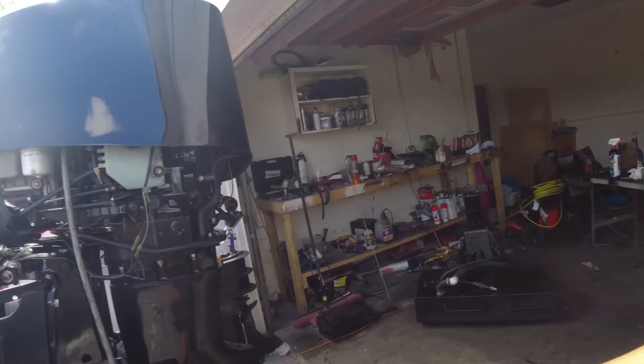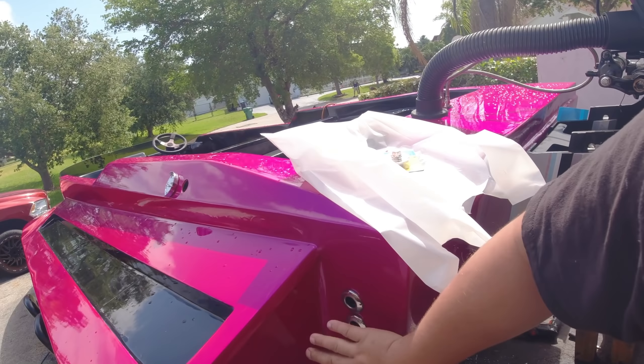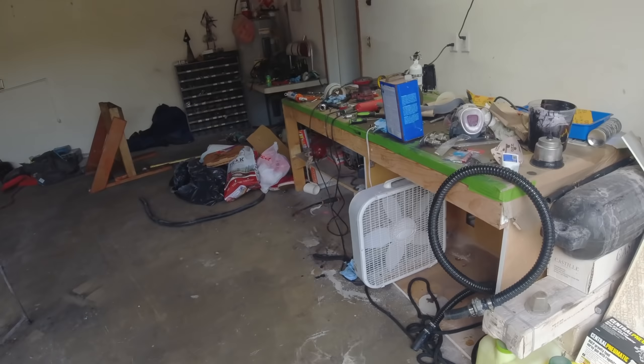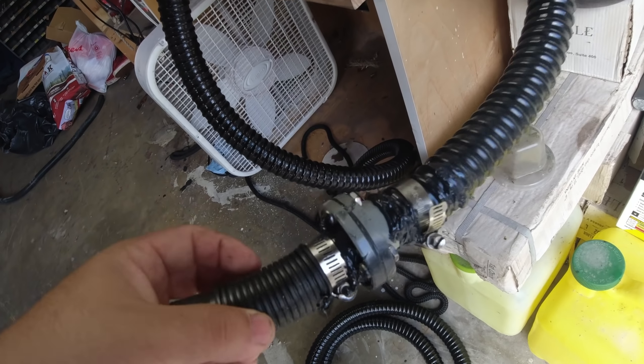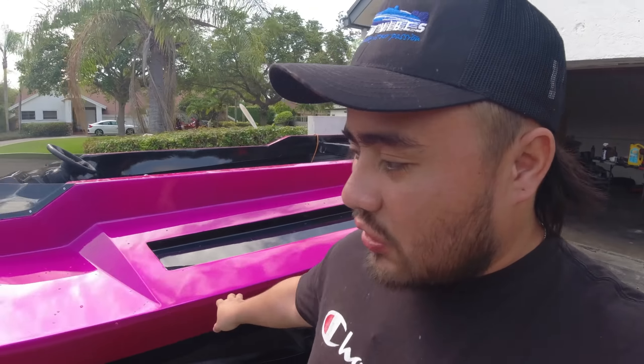We're close to going in the water. All we're missing is the fuel tank and I gotta put in the hoses for the bilge pumps. I've got some poppet valves — put some 5200 last night, let them sit to make sure they don't leak. Today's gonna be the first day she sees water because I'm swapping out the trailer. This is still gonna be the trailer for the boat, but I'm gonna be sanding her down and painting her to make the trailer look nice. For now I'm gonna be using my father's new trailer.